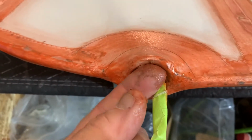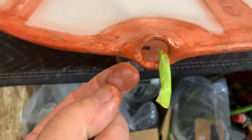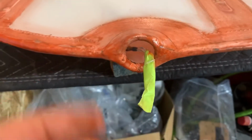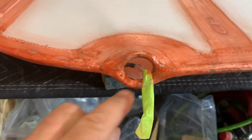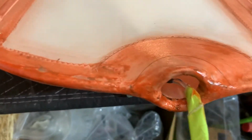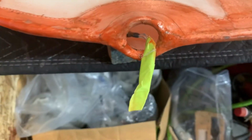I think they call them acid brushes. So those are good little throwaways. Just pull it out and get some poly tack, put it behind it, and then just push it back up in there. I just use my finger, as you can tell, and just push it back up in there and hold it as it starts to get stiff. Just keep pushing it back in there. And then later you can take the tip of your hobby iron like that, and just run it around and seal it down in there, later, to where it's in the way. Then I go ahead and pull my wire out now, cover it with some tape, and have it ready to go when we get ready to start painting it.